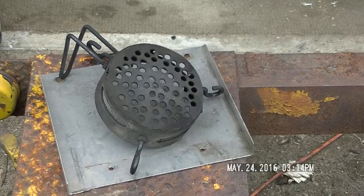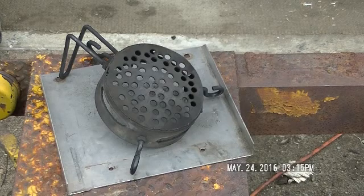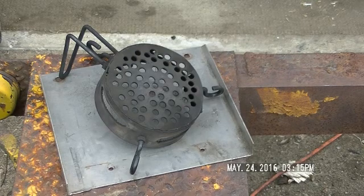What I've done is increased the size of the holes in the bottom of the grate - punched them out to 7/16ths. And this morning, that seemed to work just a little bit better but not much. I've been talking with a couple of guys about it, and I think what we have to do is make either a shallower bowl or even a dish plate as a grate to keep the cinders and charcoal moving off to the side and out of the way, so you can keep the good potent charcoal moving down through.